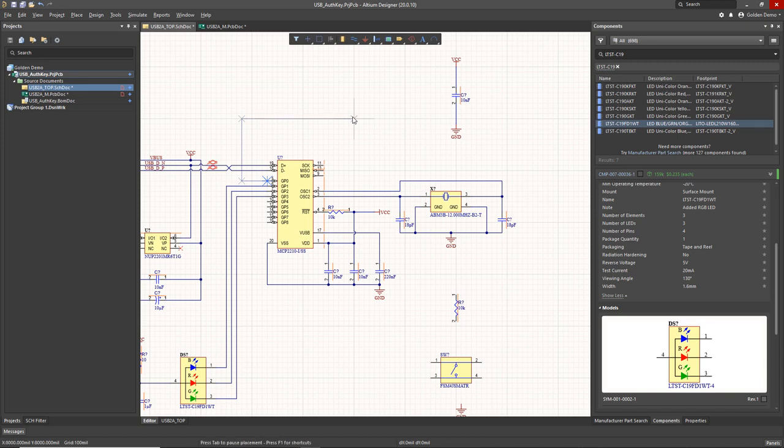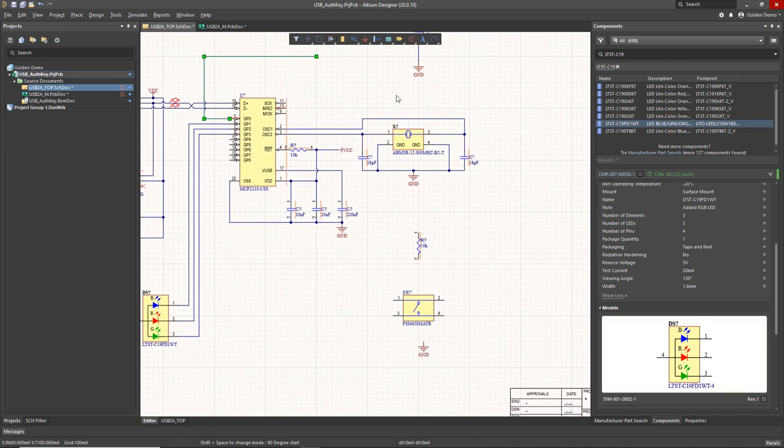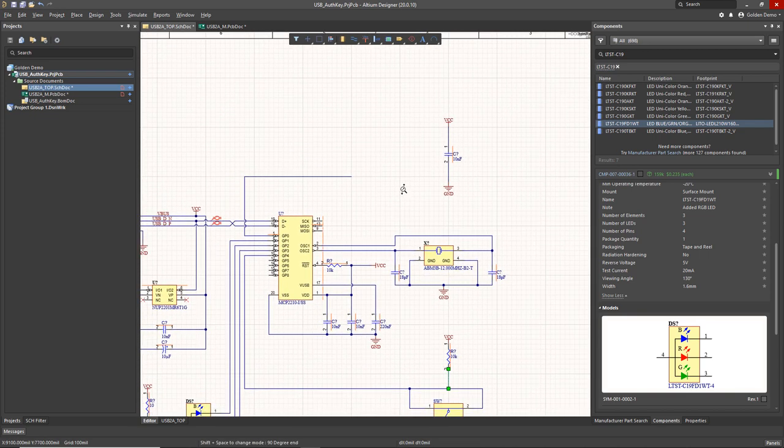GP0 on the bridge is going to be the chip select for the SPI bus. Now I need to place a VCC pull-up for the push button switch, wire that up, and that's going to go to GP4, which we'll use as an input from the push button. The bottom of the push button is going to pull down to ground. I'll wire that up centered so it looks nice, then wire up the pull-up resistor. There's my user push button switch.